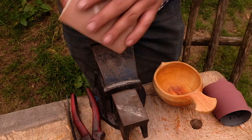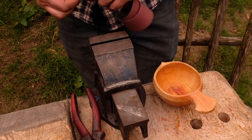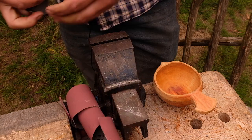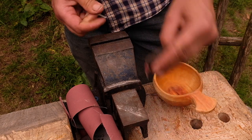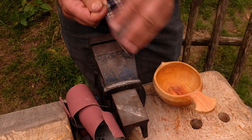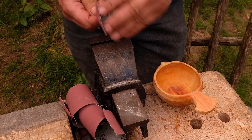We certainly don't want to put a point on it at this stage, and then I'm going to go down to some 320 grit paper to try and get a smoother finish. This I think was 120 — none of these grits are critical. So I'm going to put a little bit on the side there.